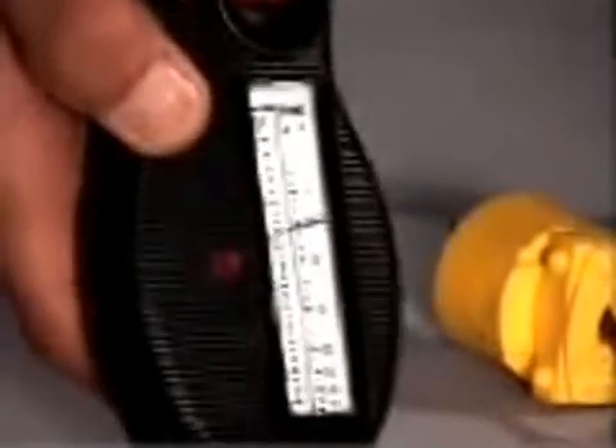Now I install my equipment, and I encourage the client to listen carefully to the sound of the motor as I connect it and let me know if they hear any change. Our equipment is connected — usually when we ask, customers hear no change in the sound of the motor, no change in the RPM, no change in horsepower. It's getting the same electricity it did a minute ago. After reaffirming that, I proceed to prove it: the motor is still getting four and a half amps on either wire — four and a half amps.